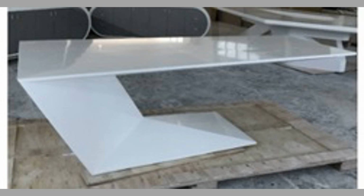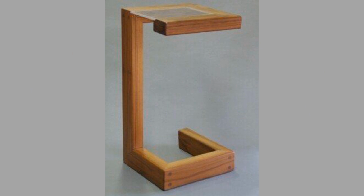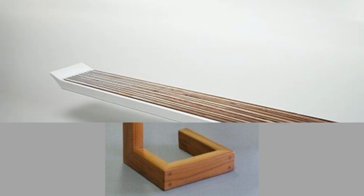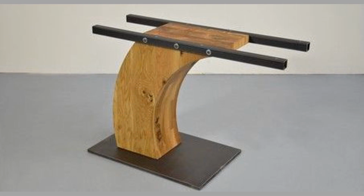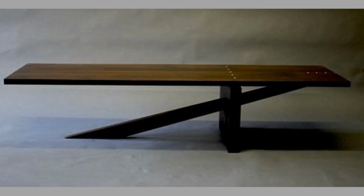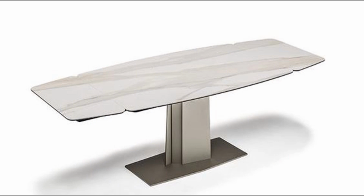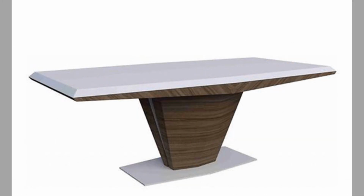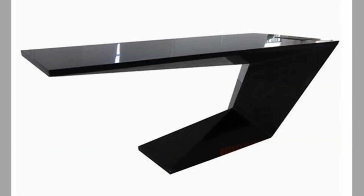A cantilever beam bends downwards when it's subjected to vertical loads. It can be subjected to point load, uniform load, or varying load. Irrespective of the type of load, it bends downwards by creating a convexity upwards. This bending creates tension in the upper fibers and compression in the lower fibers. Hence, during the design of cantilever beams, the main reinforcement is provided to the upper layer to withstand the tensile stress safely.